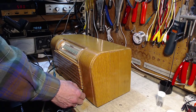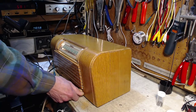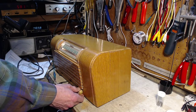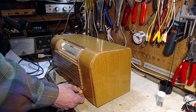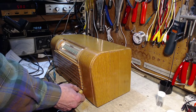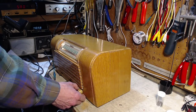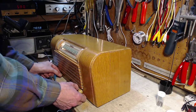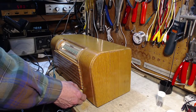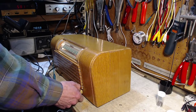That's 580. We're getting 580 — about 20 kilohertz off. Let's go way up to the other end. Now that's 1580. It looks good in the camera — it's parallax error for the pointer. It's slightly off low again, so it's a matter of moving the pointer to the right just a tiny amount. Pretty much as good as we're going to get it.